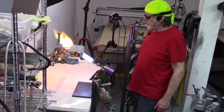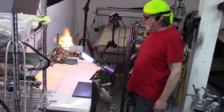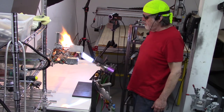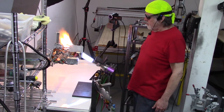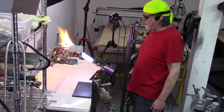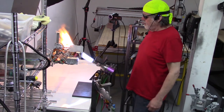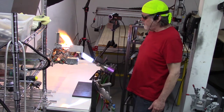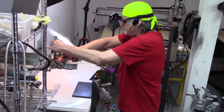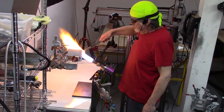I then heated up that 3 1/2 inches of the 1 inch diameter core material, put it in the squeezer, put the channels in it, the lobes in it, added the rest of the assemblies, squeezed and pulled it down to a triangle approximately 11 inches long or so. I didn't actually measure it, and about 1 1/8 inches on a side of the triangle. Then, after it was annealed and after it was cooled, I cut the center out of it, the sweet spot, the good stuff, and got 6 pieces 1.2 inches long each. And it's those pieces that I'm assembling together today and squeezing down.